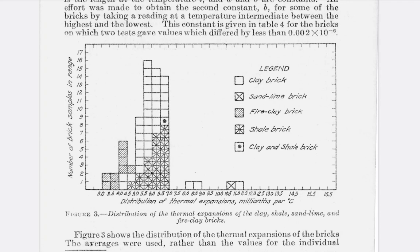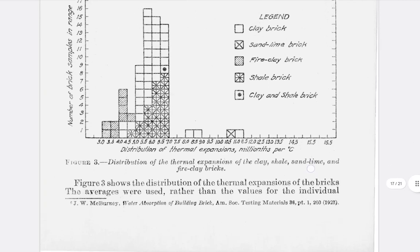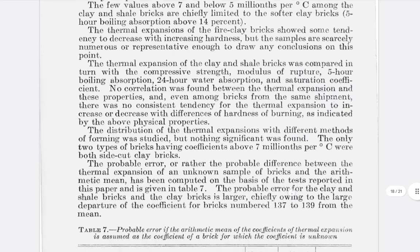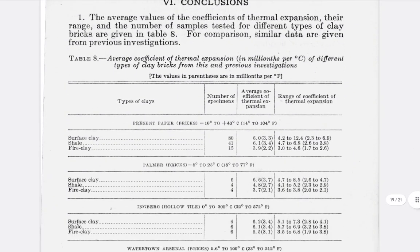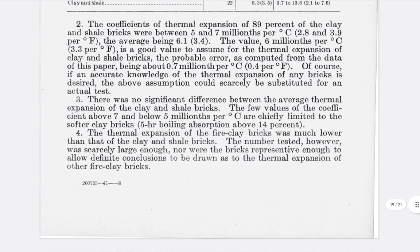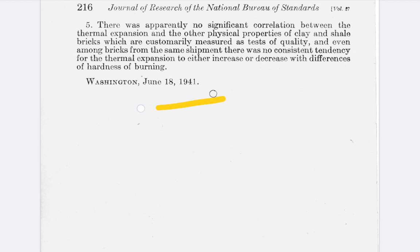And they calibrate their tools over and over again, not trusting their calibrated tools. It seems like you calibrate and then calibrate and then calibrate. It only took about 30 minutes to bring the bricks up to temperature in this oven. But they were heavy in calibration, and they used a ring type design to put the brick inside and then measure off the ring, which is one of the ways they did it, which is very different. Instead of just a pair of calipers and a straight edge. Just remember, this study's a 1941 study. This didn't really exist then, but that's their paperwork that NIST is publishing it under.